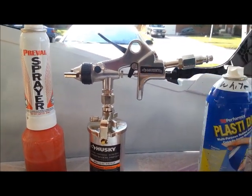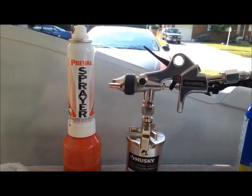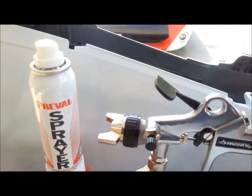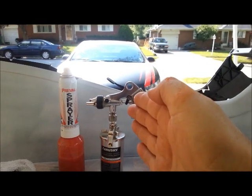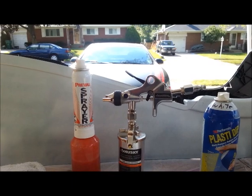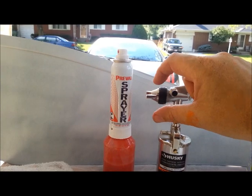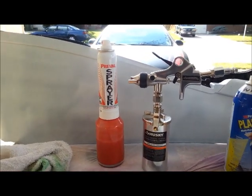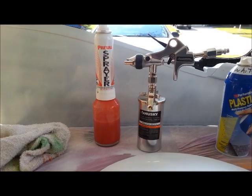This is a materials adjustment — it adjusts how far the trigger pulls back. It's got a little adjust right there, and it'll change you from a horizontal or wide pattern to a circular pattern, which is real nice. Then to spray from horizontal to vertical, you just loosen the black knob and twist it one way or the other. Overall I've been really impressed with it. I think the rest of the interior parts are going to get sprayed with this little Husky.